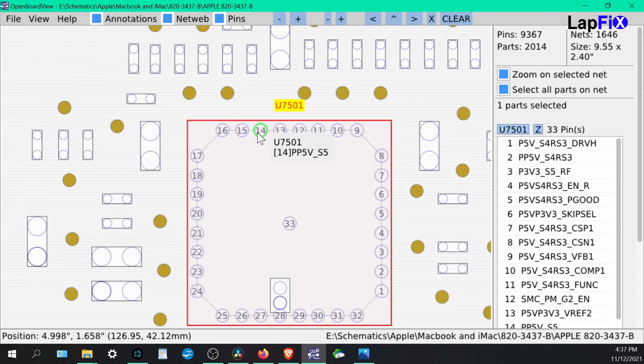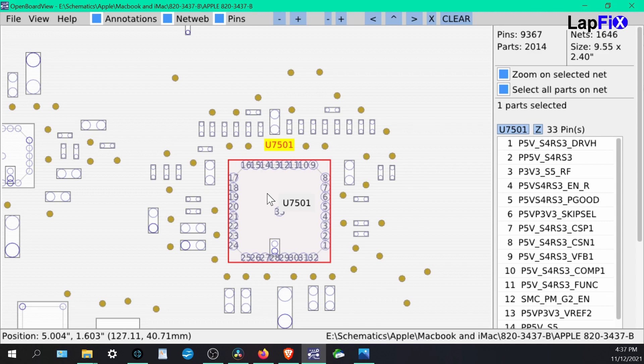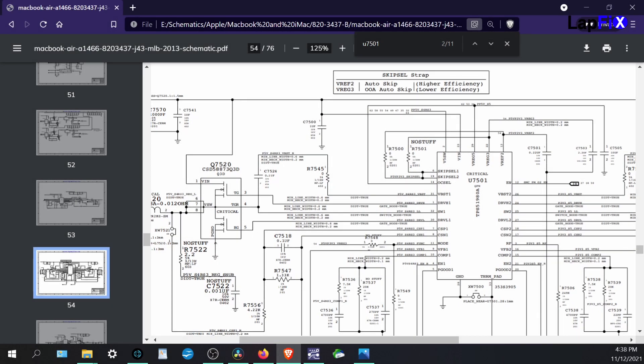You can see that this is the U7501, and this one is on the five-volt power rail. It is an IC chip — any type of liquid that's impacted it is definitely going to make sure that this laptop is not going to turn on, no fans are going to spin, nothing. If we bring up the schematic you can see how many different components and things are connected to this. We'll mainly just do a replacement — some of those pins are going to be too damaged — we'll clean it, remove it, and hope that the traces are still intact.